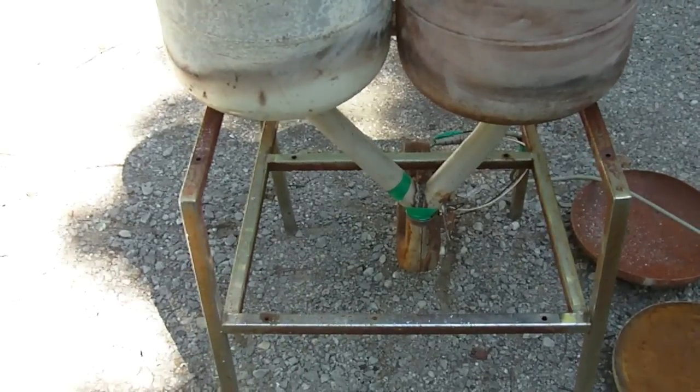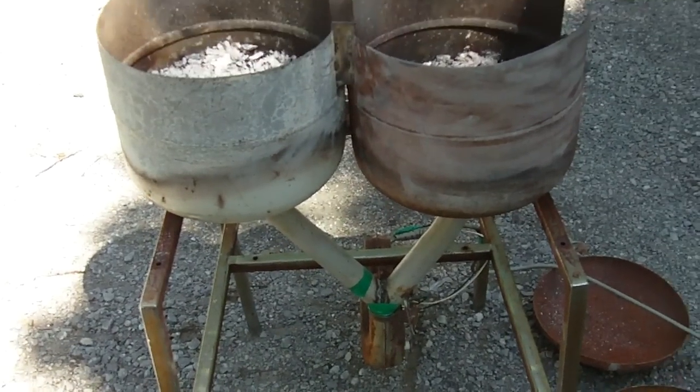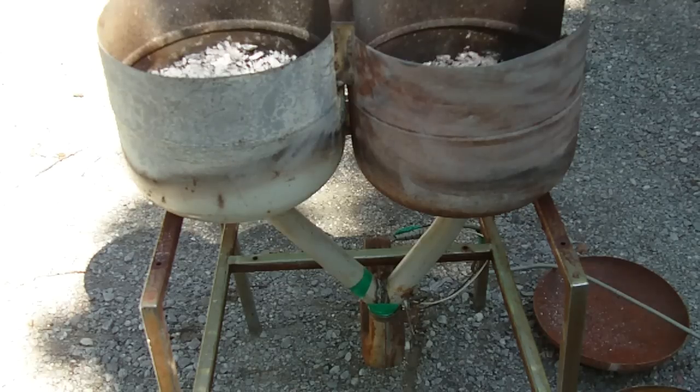This was an old office chair. For the blower I've just hooked up two tubes going from each propane bottle where the taps were on the top, and they're just welded to that and connected to the blower fan. The tubes were just from a satellite dish mounting bracket. The blower fan I think is out of a heater — it could be out of a small dryer. It has heating elements on it which I disconnected. You could use an old hair dryer or something like that.